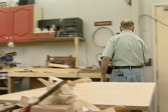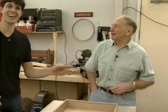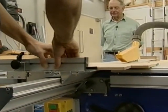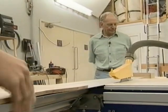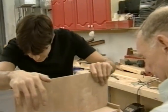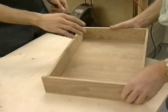So it's one of your little projects, isn't it Dennis? While I was painstakingly cutting out the fretwork, it seems to have stayed together. Is that alright if I check it and see whether it's square or not? It will be anyway — if it ain't, he made it. Spot on. With the drawer sides ready, we can cut the base to size. Because it's quite bowed, I have to apply lots of pressure to keep it flat down on the bed because the cutter is cutting from the base. It's really nice — a nice solid oak drawer. You don't see many of those made around these days.